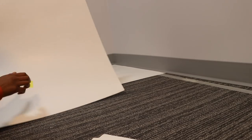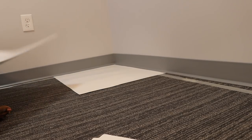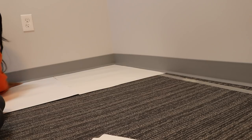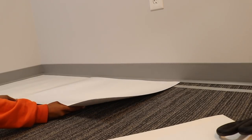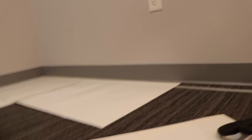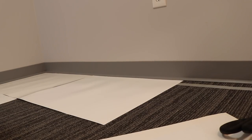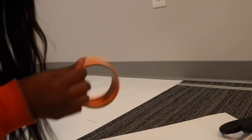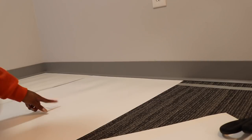Now I'm going to put another poster board down. Remember to have the laminate side up and the paper side down, and put it right next to the other one. Do not overlap — if you overlap, it'll leave an air bubble type of gap. It's okay if you have a little bit of space in between. In the middle of the floor you don't really have to worry about putting more carpet tape — you really just want to make sure you put the carpet tape on the perimeter of your room. I'm going to lay basically four boards down for now, then take the clear Gorilla tape or duct tape and tape the corners of the boards together.